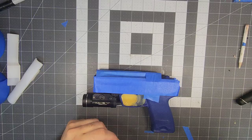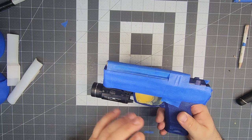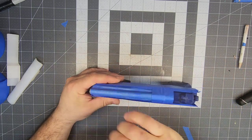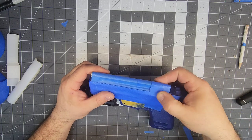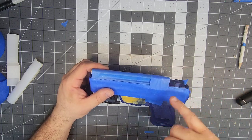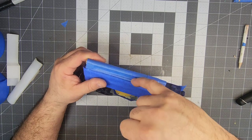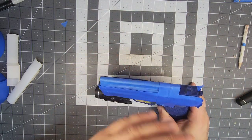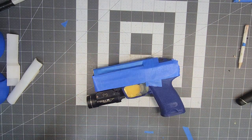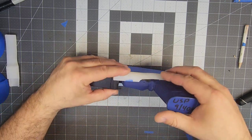Let's go to town. All right, so I got my 5 layers of tape on each side, and I went ahead. When I do this, I like to put one very tight one over, and you'll notice when the holster's complete, the Kydex won't sink in here, and then it'll gradually sink into this one. So it leaves like a channel for the sight channel, and I think it looks absolutely pisser. So I'm gonna keep incorporating that. But for now, I'm gonna go ahead, throw these in.